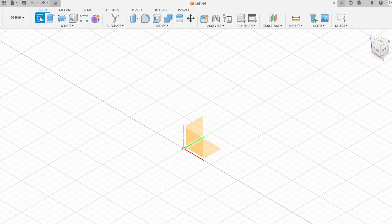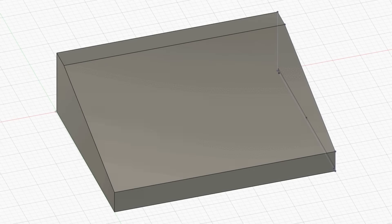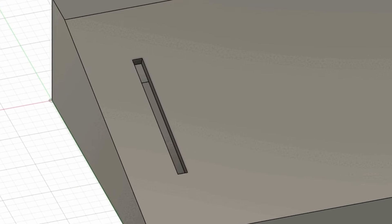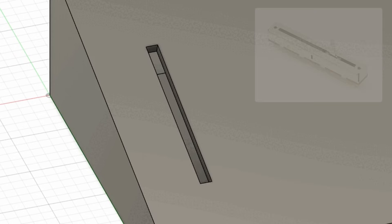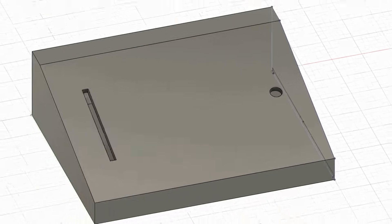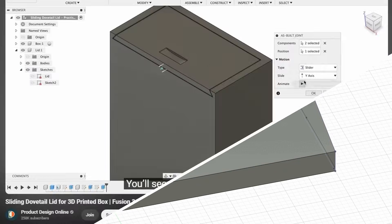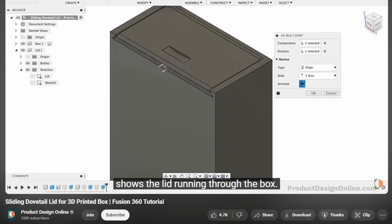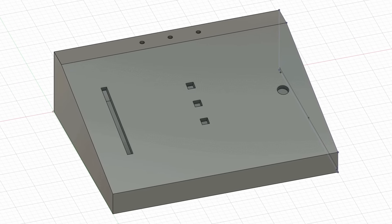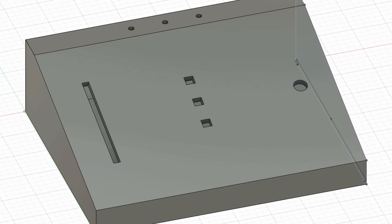Pulling up Autodesk Fusion 360, it's time to get to work on this controller. Using a sketch I did earlier I started to work on the model. I added spaces to the left and right for my potentiometers — one is going to be a linear potentiometer, basically a slider, and the other is a rotary potentiometer. I then created the holes for the LEDs and the buttons before realizing I actually need to be able to open the box to put the components inside. So I pulled up a tutorial to figure out how to create some kind of sliding contraption. This is the final 3D model all sized up and ready to go — now I just need to send it off to the robotics lab to get 3D printed.